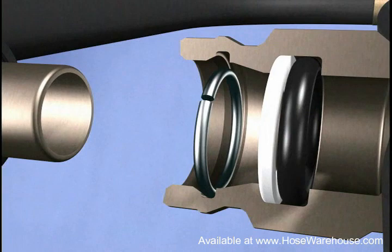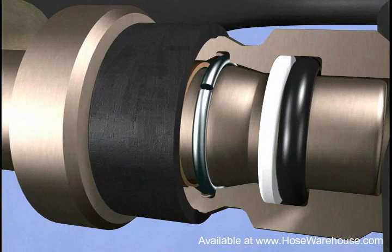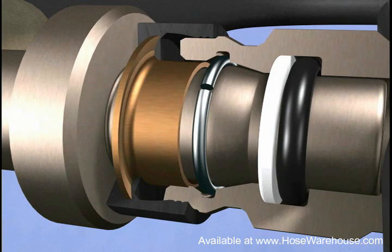Here's how it works. When the hose is inserted, the wire latch ring slides up and over the male half ramp on the hose fitting and locks the hose in place. The O-ring and backup ring provide a high-pressure seal. The rubber release sleeve also seals the connection, guarding against outside contamination.